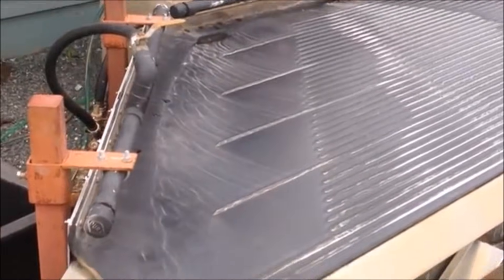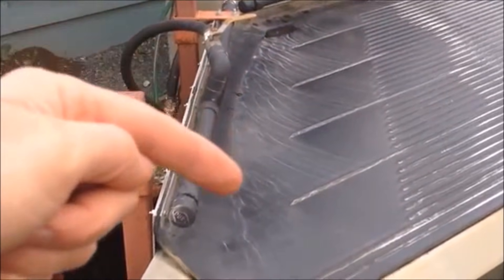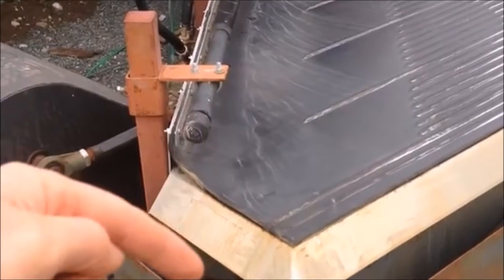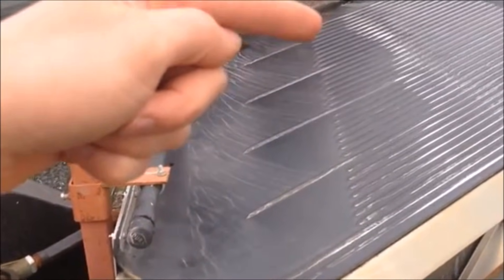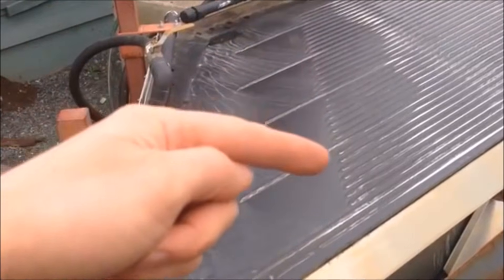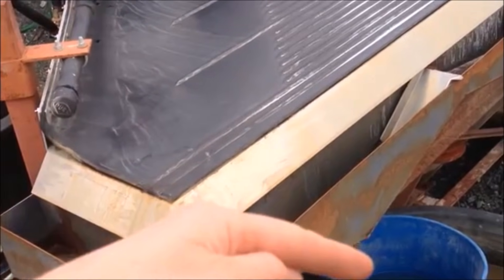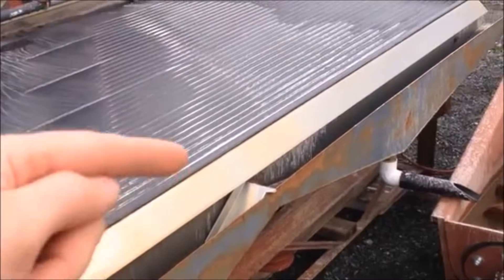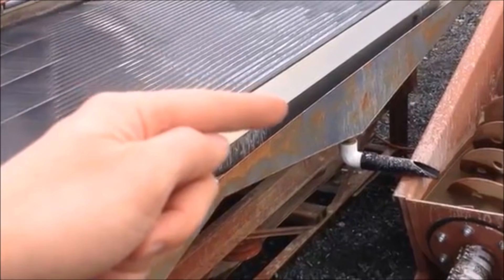The high-grade material and gold is going to come across these grooves and make a line down under the water bar here into the number one high-grade and number two high-grade. Your sulfides and concentrates are going to come down, form a band at the tips of these grooves, and come down into the number three port, or the middlings. Quartz and waste material are going to come down into the tailing port.